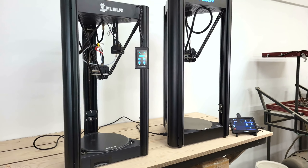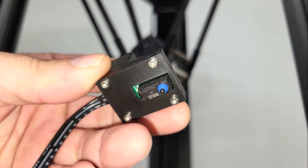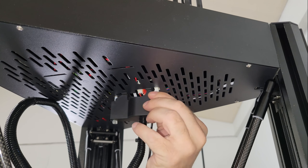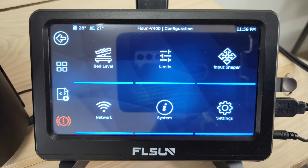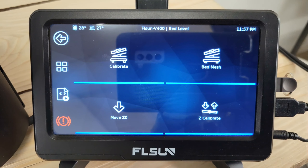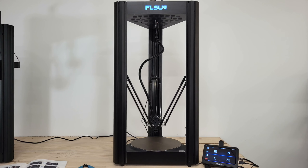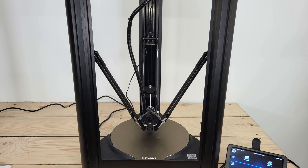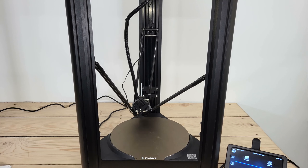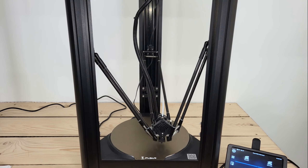The first thing that I wanted to do after turning on the machine was calibrate it, so I attached the magnetic Z probe to the print head and started the bed mesh calibration. To improve adhesion and get the best quality prints, most machines today use auto bed leveling. This automatically adjusts the Z axis while printing to compensate for any slight deviations in the build plate, which the machine measures during calibration by jogging the print head to multiple locations around the work area and lowering the Z probe until it touches the build plate. Then it develops a 3D mesh of the bed from those measurements that it can use for reference while printing.